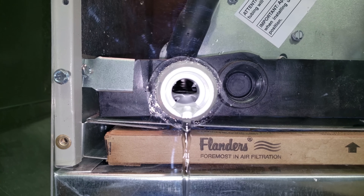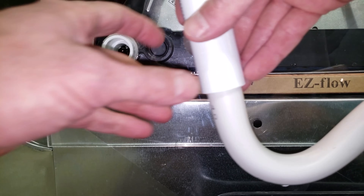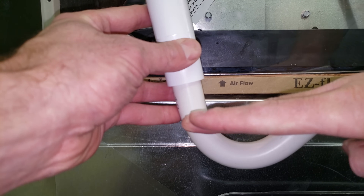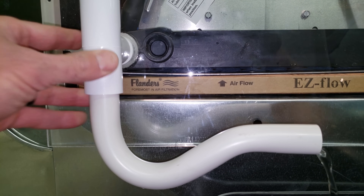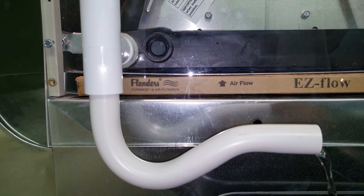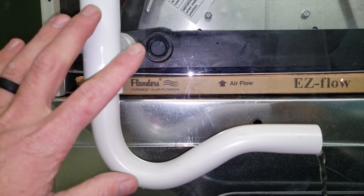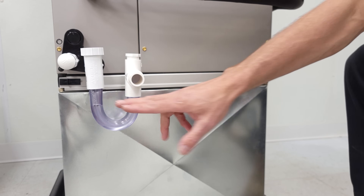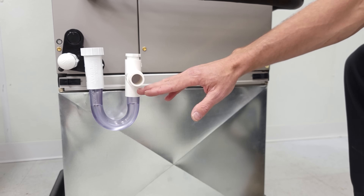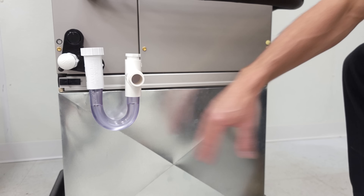With the system off, all the water drains out. Now I'm adding a trap that already has water in the bottom — and you can see it's allowing all the condensate in the pan to drain out properly. That's how the condensate trap works. On a ducted air handler, you definitely need some type of a trap. This U-trap has enough height to overcome most of the friction you'd measure in inches of water column.